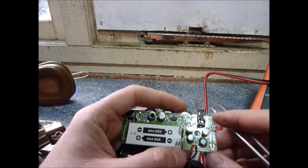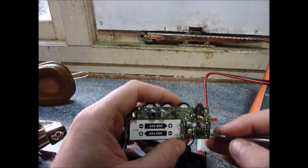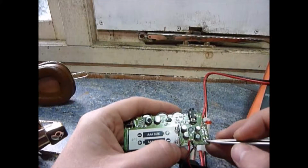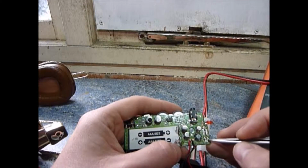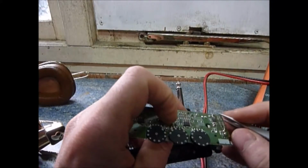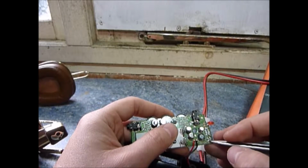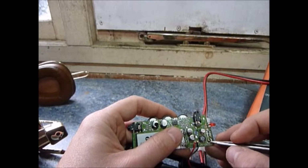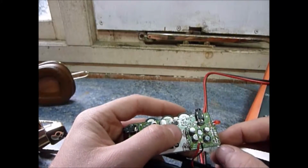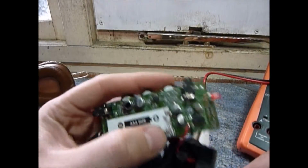Which obviously isn't great. Obviously everything on here is quite low voltage, but with these types of connections, solder shorts are always a possibility. Perhaps the routing could be a little bit different. Certainly you've got to question whether you actually want the solder mask. Even solder masking off this may have been a better idea. You've certainly got plenty of wires through there anyway. You don't really have to rely on a slug of solder for anything. It's all quite low current, so maybe it was a short crying out to happen, but that seems like that may have been the problem. So what we're going to do is bob the switch back in and see if we have the same issues.